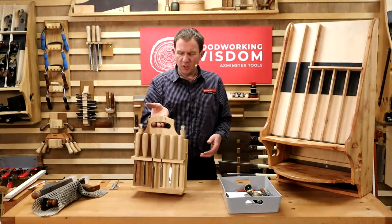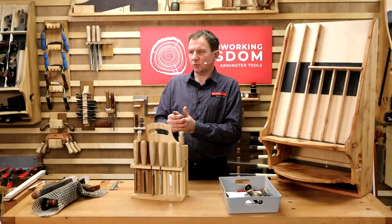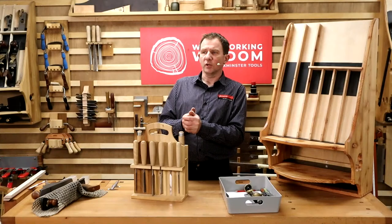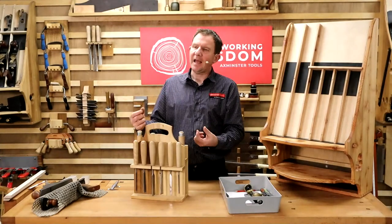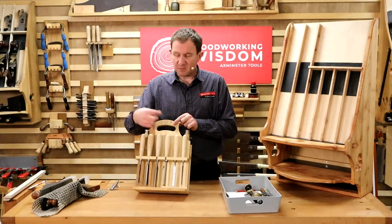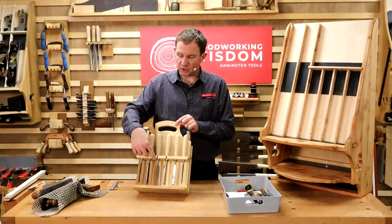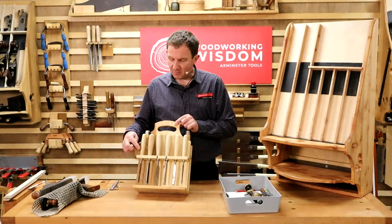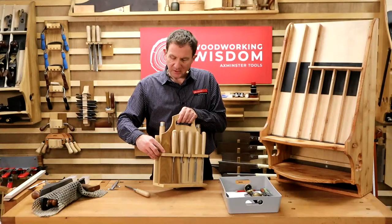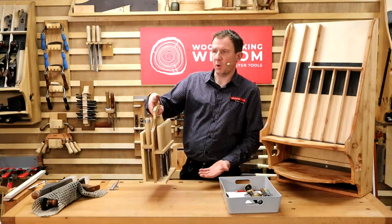Going back to the design process for that chisel box: first I laid out my six chisels and asked where do I want those? The best way you can do something like this is draw it up full size on a bit of MDF or plywood — draw up your idea, where your holes are going to be, the spacings, the handles. Possibly even the ferrule size will play a part because they might vary. The bigger chisels near the middle have a bigger handle, but the ferrule size is the same. Placing those near the centre means they're less likely to get knocked out and the timber is less likely to break on that last hole. All those little things start to come into the design, but it's quite usable as a box you can take around.